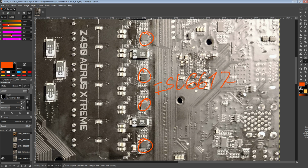In interleaved mode, they give you a higher phase count, which improves your input ripple, and that's about it. It improves your input ripple and improves your efficiency slightly. And then they have synchronous mode where they'll not interleave the phases at all. But what's cool with these is they monitor the current going through each power stage that they're controlling. Even in synchronous mode, these do PWM pulse extensions, so these will still current balance the power stages they're in charge of. So you can have an 8-phase VRM, but with 16 power stage current balancing. Your input ripple is going to be somewhat worse due to the lower phase count, but your efficiency is going to be closer to that of the 16 phase setup than not.